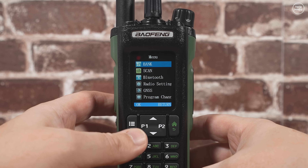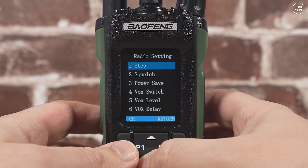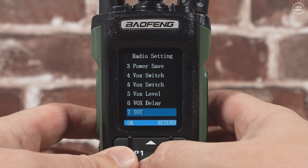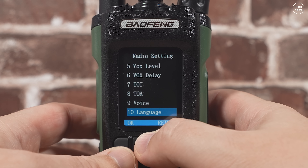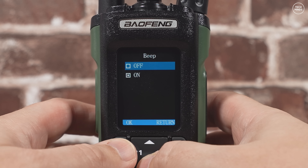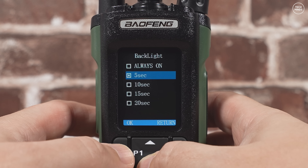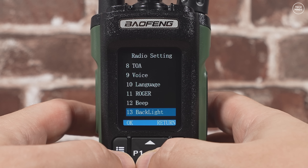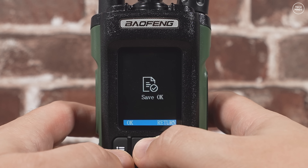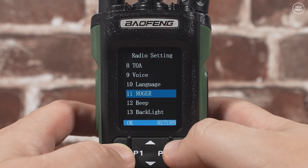The zone feature is useful if you want to group certain memories together, like local repeaters or repeaters at your holiday home. The menu system is different to what I've seen before, but it's actually pretty easy to navigate. The first settings I always turn off on these radios are the beeps and voice prompts — a synthesized voice that tells you what you've just performed. I also like to make sure the LCD backlight stays on all the time, which is easily changed. GPS can also be enabled or disabled through the menu, and apart from showing latitude, longitude, and altitude and storing around 10 waypoints, that's about as useful as the built-in GPS gets.